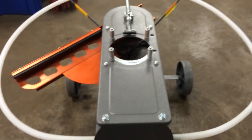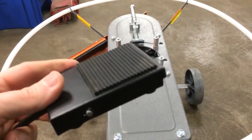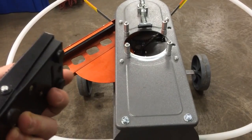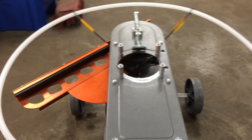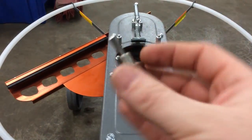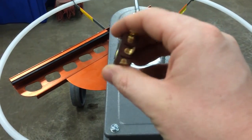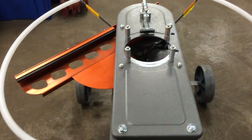The next most common issue could potentially be the foot pedal. If the foot pedal is sticking and not springing back up, and you don't hear the clicks on the inside anymore, that could be causing your constant rapid fire issue as well. The third and least common issue could be the power switch itself — that would be an issue where your power switch is wired incorrectly, always sending power to the motor instead of running the electronic parts.